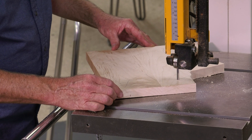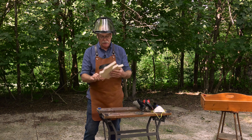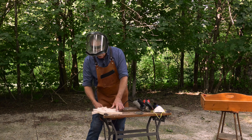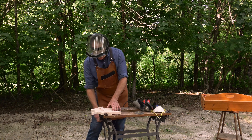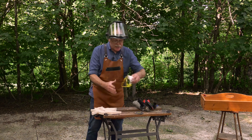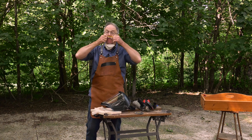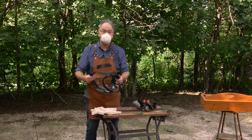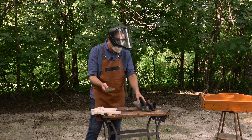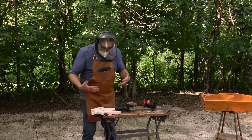That's how the leaf shapes up from the bandsaw. Susie wants this for her ladle rest on her oven, so I need to scallop this out to hold that. An N95 dust mask is required because we're going to use tungsten carbide cutters to scallop this out. We could use hand chisels — there are a bunch of different ways to do this, different types of cutters, different grits. We're using a coarse one today.